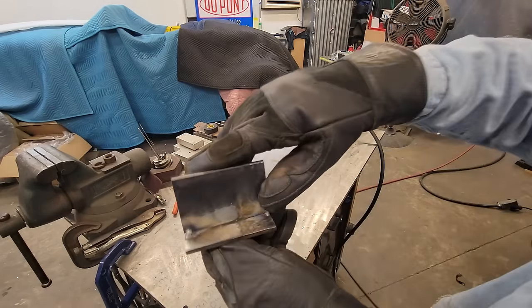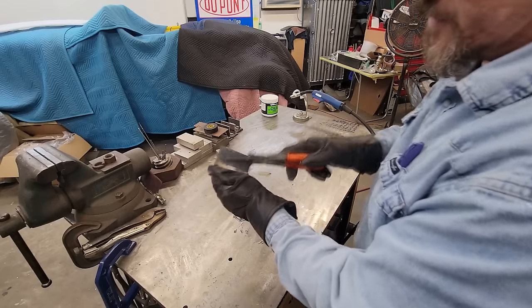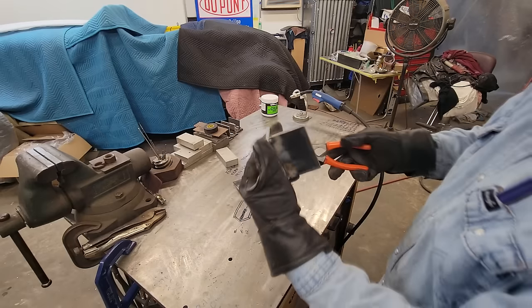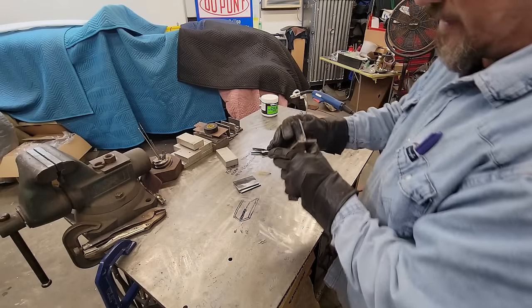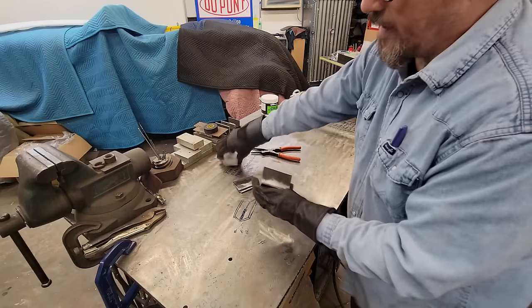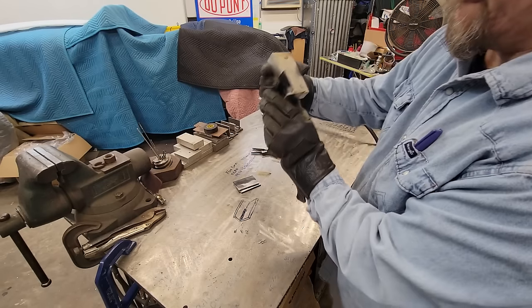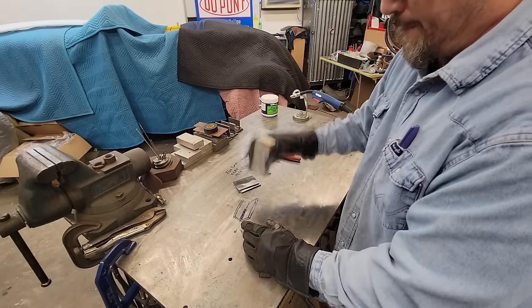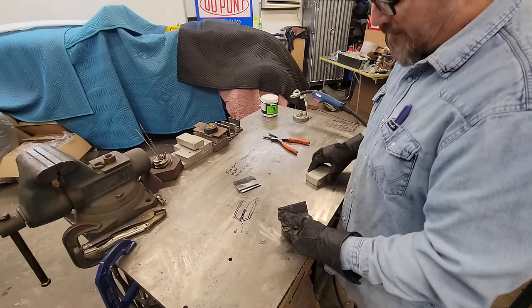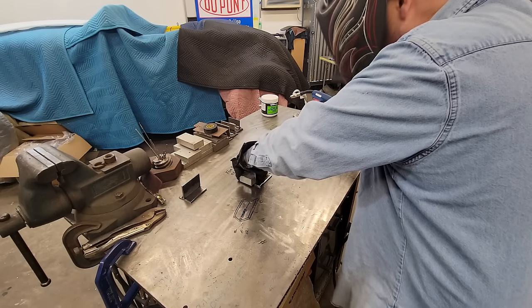Right there, you'll get a little slag on there you have to scratch off. Get a good wire brush. That's why I'm tacking the backside, so I ain't gotta worry about getting that stuff off. Good parallel there. Yeah, that's close enough. See that mess? Look there, it just wipes away. Here we go, time to make some more smoke.